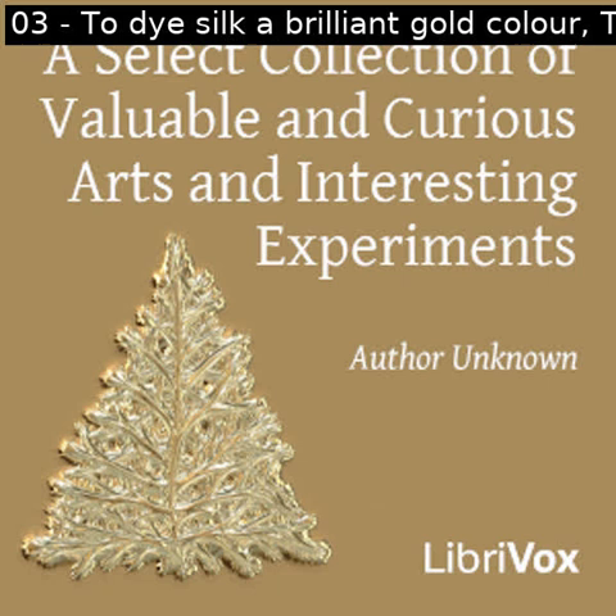The gold will soon be revived and the silk will become beautifully and permanently gilt. Any letters or figures may be drawn on the silk with a camel hair pencil dipped in the solution, and on being exposed to the action of the gas will be revived and shine with metallic brilliancy. Note: the silk must be kept moist with water till the gold is revived. Zinc may be prepared for this purpose by melting it and stirring it continually with a stick or iron rod while it is cooling, or it may be pulverized with a hammer as soon as it becomes solid.